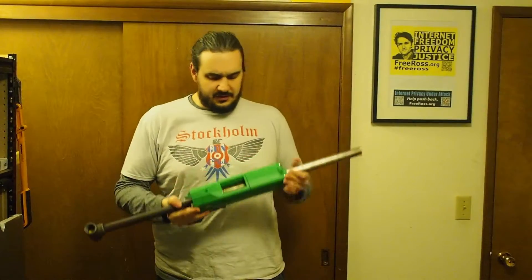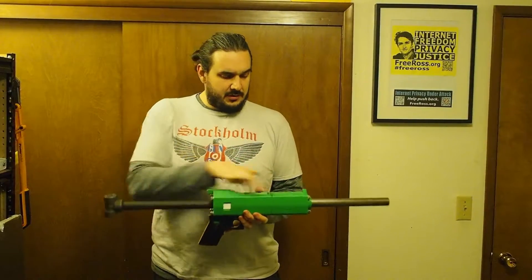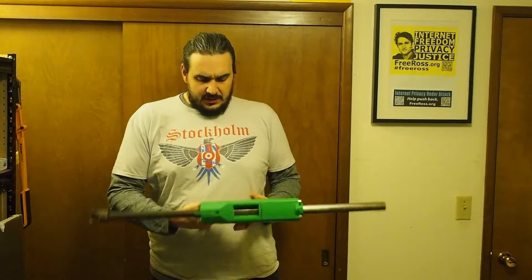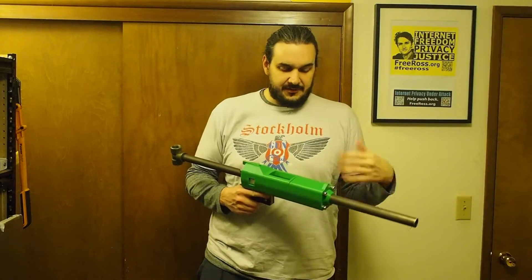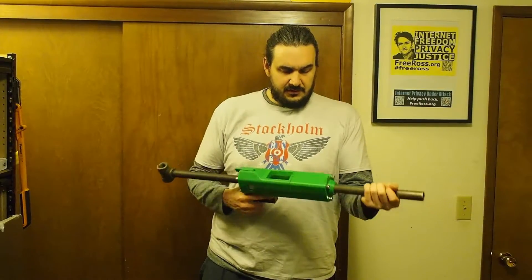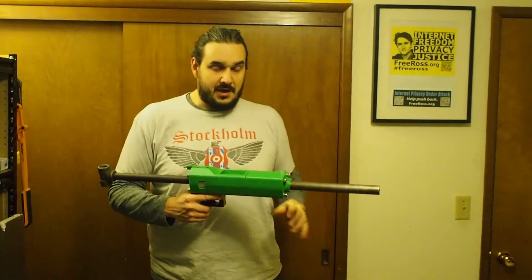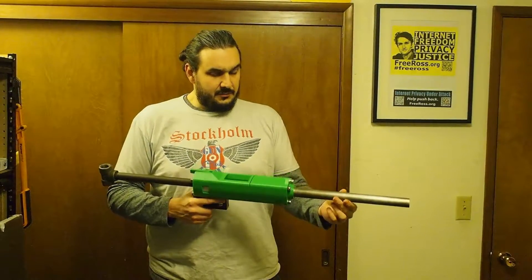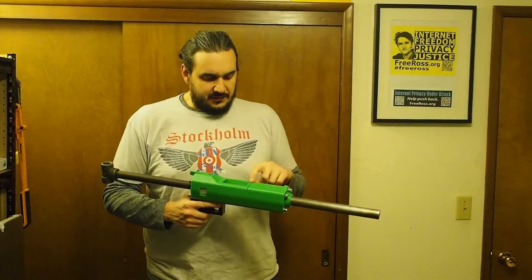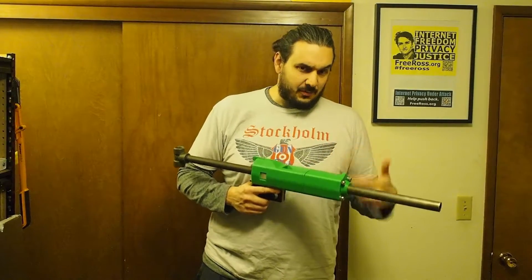That's the fancy version. Here's the simple version — this is designed to work with a 12-inch threaded rod, so you can just go in the store and pick them up. In the last test, the thing I was really excited about is that this setup worked — the barrel locking mechanism. There are printed locking lugs with a four-lobed locking lug system and a track for it to slide down. The lugs are held onto the barrel with a double shaft collar. The big test was around that, and it works pretty well.